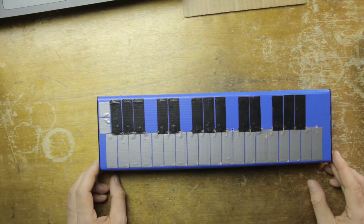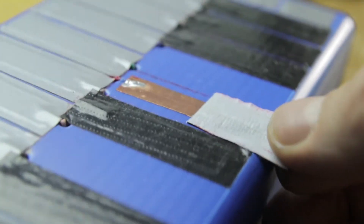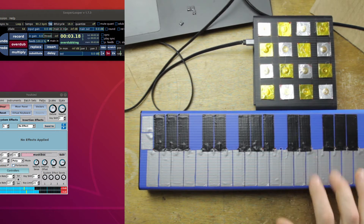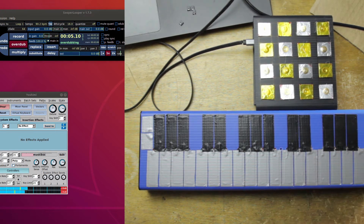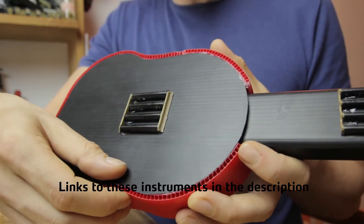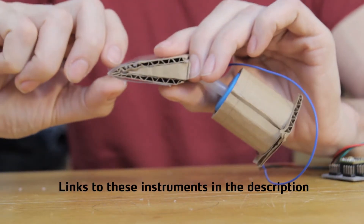Capacitive sensors — specifically the one-cable sensors on the Teensy microcontrollers — are really the main muscle which makes the click work. They are versatile, powerful, and simple. I use them for keyboard keys, string sensors, wind instrument keys, lip sensors on mouthpieces, and pretty much anything I want to activate directly with some body part. But they are not infallible. Because of the way they work — by measuring an intangible electrical field — they are very sensitive to some kinds of interference.